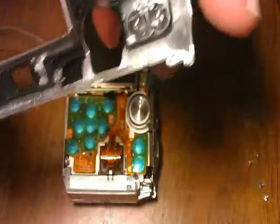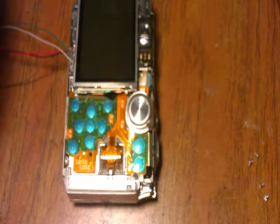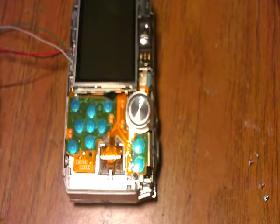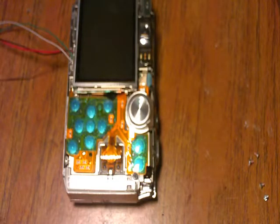I like to slot mine, because that way if I have to take the camera apart, I can take it apart. Make sure it's cleaned up after you slot it, or you can drill a hole there if you want. But the hole always gets me when I have to tear it apart — or say one of your wires comes off. You never know when you drop a camera in the field and pull the wires — it's happened. Make sure there's no burrs there to cut your wires — be very aware of that. Now we can put your wires in that slot.